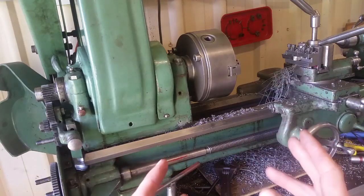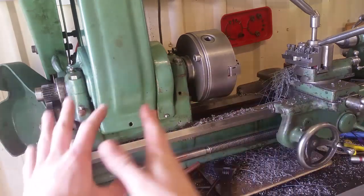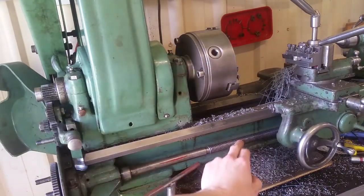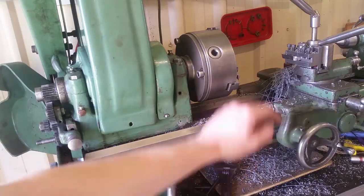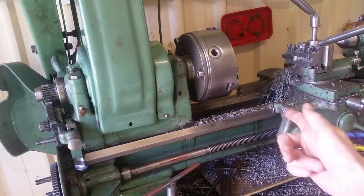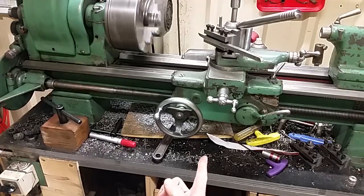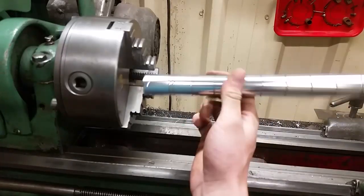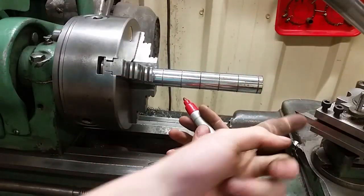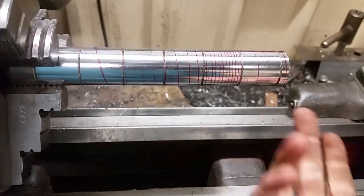It's come to my attention that some people watching this channel might not understand machining or what I'm trying to do with this gearbox. The gearbox goes on the back of the lathe and it synchronizes the spindle with the lead screw. It turns the lead screw at a certain rate compared to the chuck, which drives the carriage and lets me cut threads or just progress a tool and take a cut. If I flick this lever the carriage starts to move on its own. Now replace the pen with a cutting tool and you've got a thread.